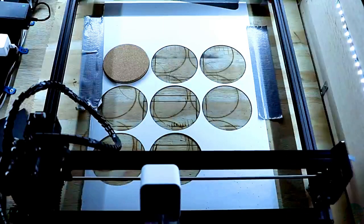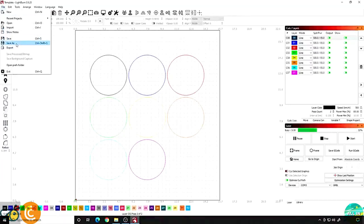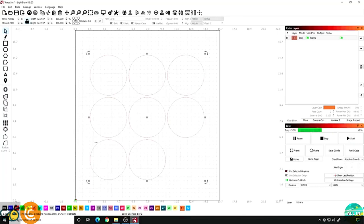So all you have to do now is go back to the laser, set up your files, and then hit start. Now that the cut is all done and everything is good to go, there are a couple last steps. Number one, we want to save this — go up to file and hit save. It's going to save it as a LightBurn file so you can always open this back up. Now the next thing you want to do — because you already have these circles burned in — is you don't want to burn them in when you actually do your templates. So highlight them all with Ctrl+A and make them a tool path — T1. Once you make them a tool path, it's identical to what we had before, but it is not going to burn in. It will show the frame if you try, but it won't burn in anytime you do any of your projects.